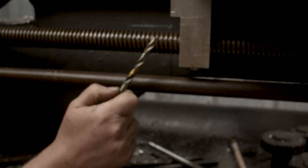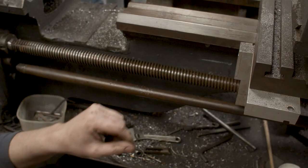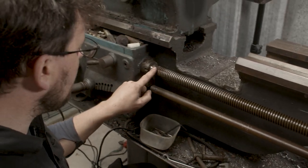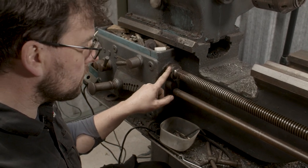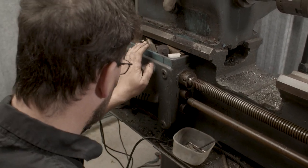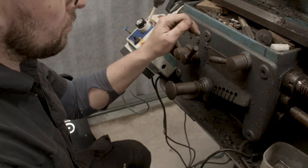Anyway, the heel of the hunt, I eventually got it all to work, and I have this Acme thread connected up here and it's connected to the cross slide. I then remade this shaft here where it joins into the original gearbox, and the original gear kit is running it here. So this is the change gears for screw thread cutting.